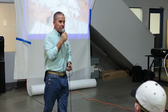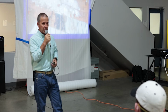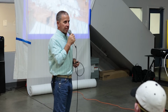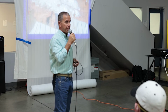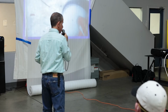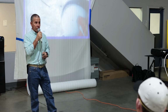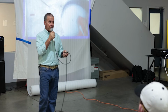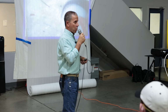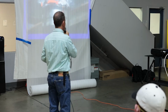So really the reason this occurs is because of a lack of oxygen. Once again, aluminum that is exposed to air develops a very corrosion-resistant aluminum oxide coating, and that all works fairly well. It's once we remove the air and continue to expose it to moisture that we get the problem. So again, in an area where there's decking material over aluminum, it may be adhered, it may be a matting that has been glued down to the deck, for instance. Once water begins to penetrate beneath that, that aluminum becomes susceptible to poultice corrosion.